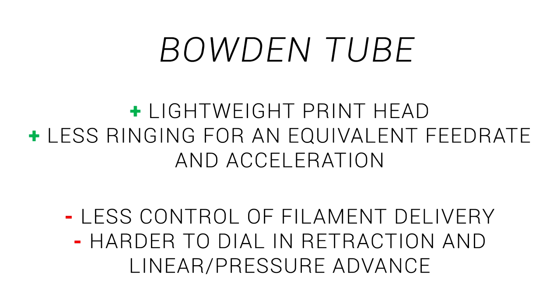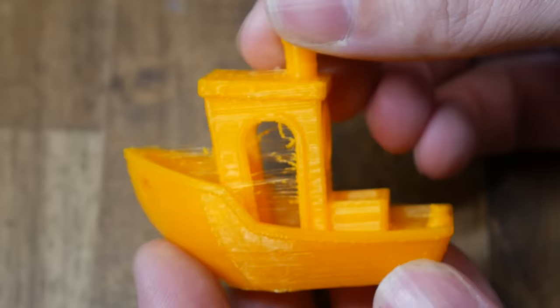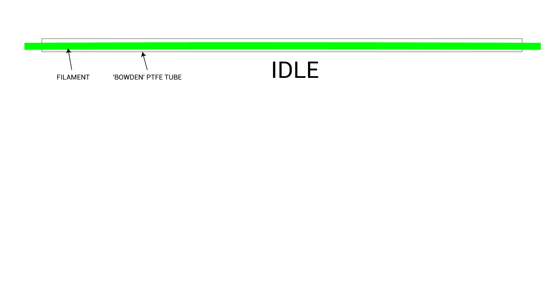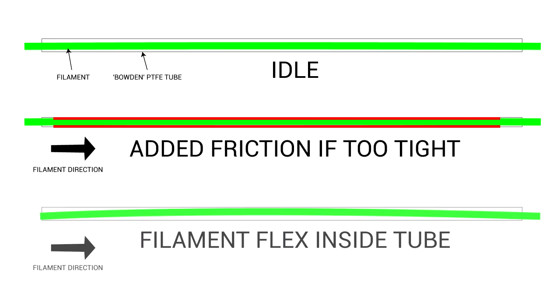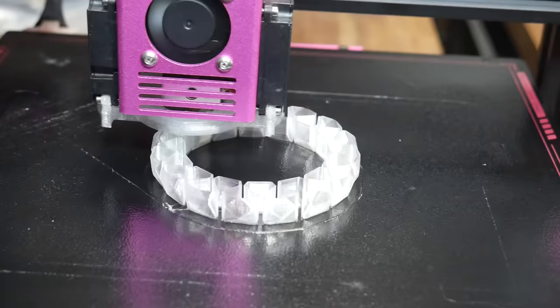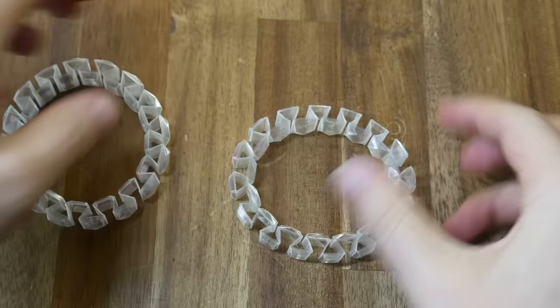But there are downsides, and it basically comes down to having less control of the filament delivery. Here's a Tronxy Core XY 3D printer that I previously reviewed — it had an excessively long Bowden tube setup, which made retraction a nightmare. The end result? Hard to tune out stringing. The filament slides smoothly inside the PTFE tube, but we need a slightly looser fit to ensure nothing binds, which means the filament is free to flex inside. The longer the Bowden tube, the greater the disconnect between the extruder drive and the hotend, and the more inaccuracy we have to deal with. That's not to say you can't eliminate stringing with a Bowden tube setup — most of the time you can, even with flexible filaments — but it's just going to be easier with a direct drive setup.